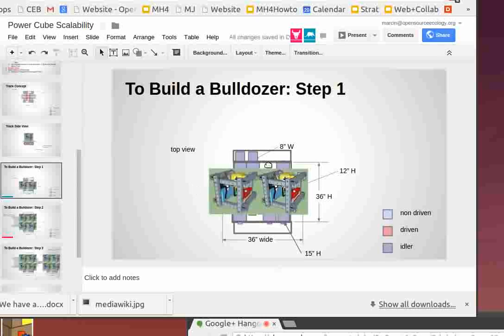Actually, there's a little detail in the sense that if the drive wheels are towards the center of the track, that is the place where the least axial thrust happens, as opposed to the front and back of the track. So this is very favorable, like a minimum design. With off-the-shelf bearings, which cost $50 for the 3-inch bearings, which is dirt cheap, and 3 inches is a monstrous size, you're able to build a multiple deca-ton machine.